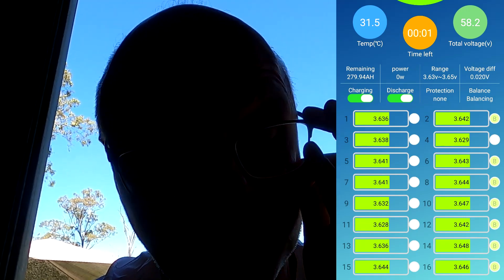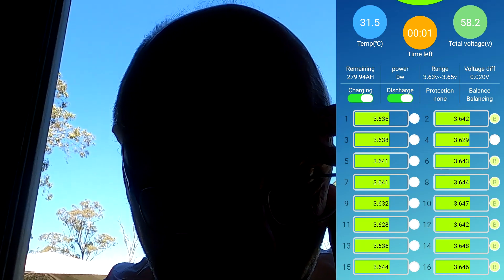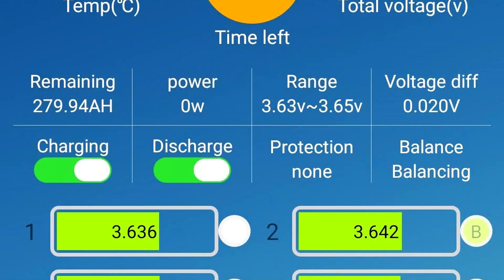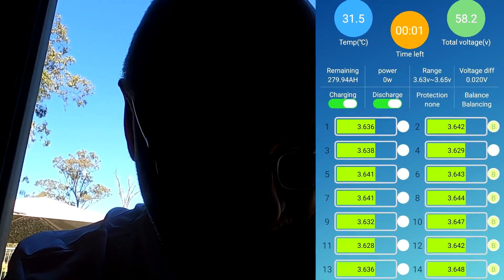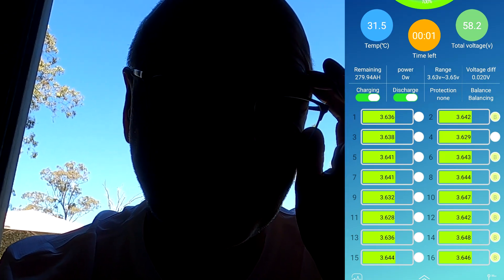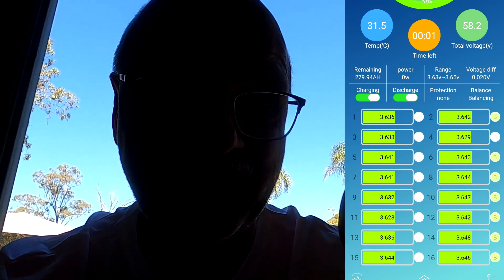On this screenshot you can see 58.2 volts — roughly 3.6 volts per cell. The cells were pretty much balanced. Because I have two of these balancers, I replaced it with the new one to check if the original was faulty, but the new one did exactly the same. So it's not the balancer — I'll explain this in a second. At this point we had about 20 millivolt deviation across all cells at around 3.62–3.64 volts, everything over 3.6 volts.